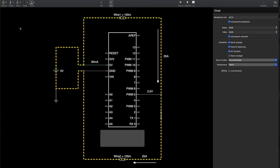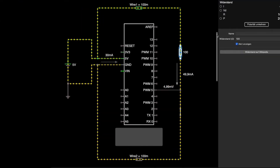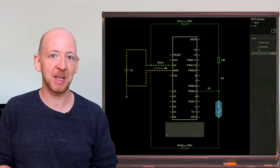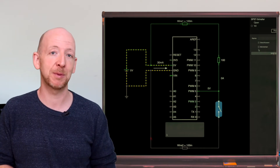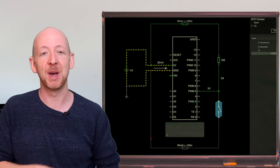Let's insert another resistor into the circuit directly above the node to the input pin, starting with 100 ohms. The overall situation of the circuit has greatly improved after inserting this resistor. The pin potential has changed to roughly 5 millivolts, which is close to zero, and the current has gone down to 50 milliamps only. When we open the switch the potential goes up to 5 volts again. However, even though 5 millivolts is almost zero, 50 milliamps still seems unnecessary to waste on changing a simple pin state — it would drain your battery pretty quickly.